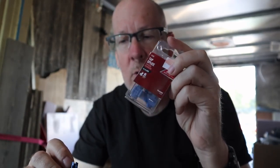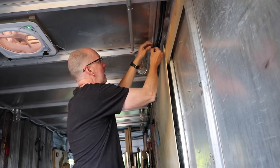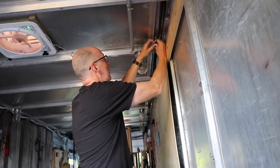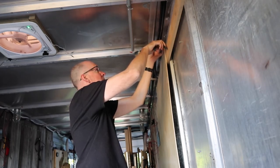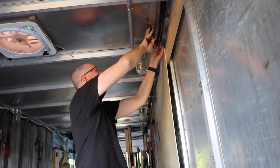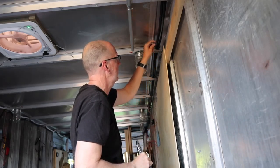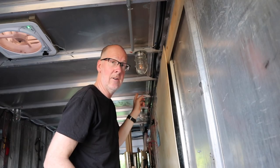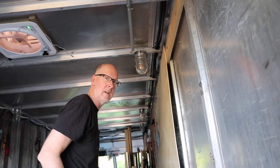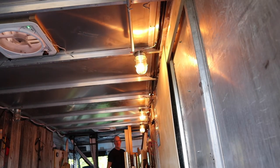So this is my ground wire that I just ran, and you just clip the tap splice up through here and make sure it's all the way in. I squeeze down on it to get the two wires sandwiched together, and that little cap just clicks into place. If I did it right I should be able to flip the switch and have this light and the others come on. Flipping the switch now - and it worked! Pretty cool. I'm excited when this stuff works the way it's supposed to. That's all I have for this episode, thank you for watching, savor the moment, see you next episode.